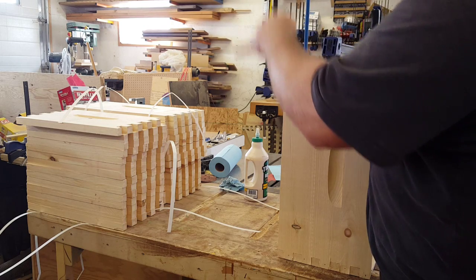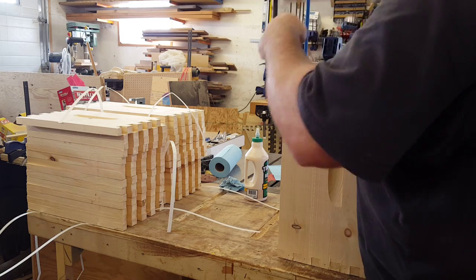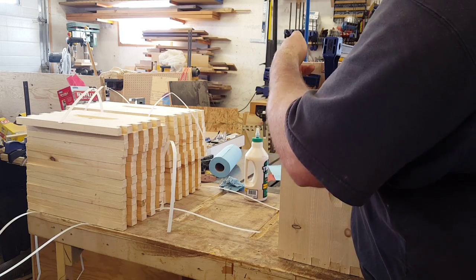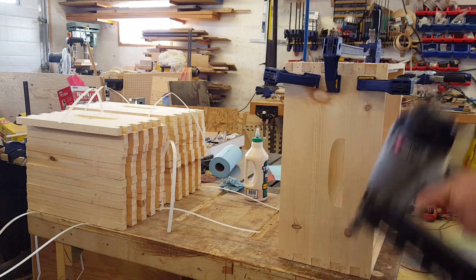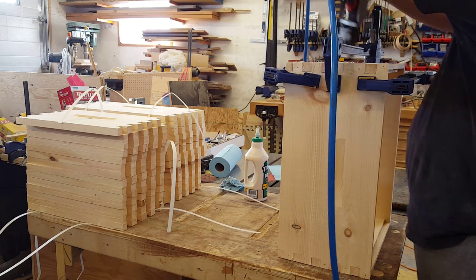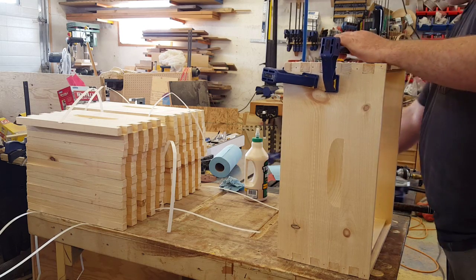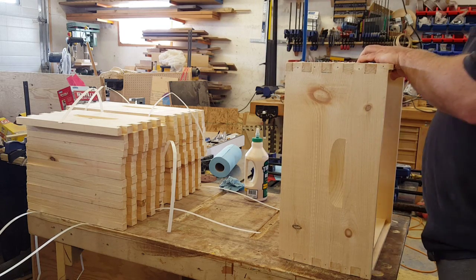It's nice, but this finger is a little short, so I could just angle a little bit, so I know it's going to go into the pine. Sometimes you can shoot it straight, but because of the way the grain goes, this grain I can see kind of goes like this, right at the top. It'll hit that grain, and then end up coming out the bottom of your box. So I find it works universally if I just angle that one just a little toward the inside, and no problems. It takes me about 15 minutes to do a box if I'm on a roll.